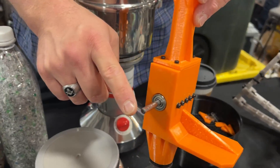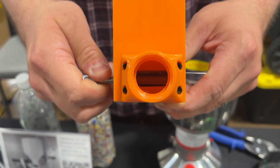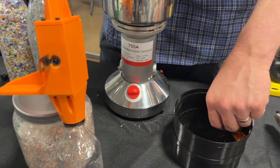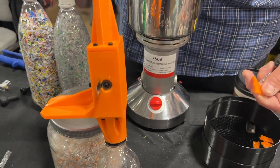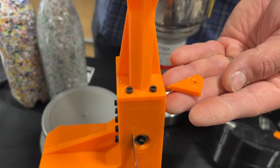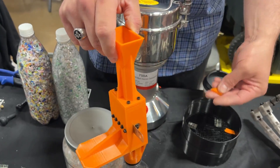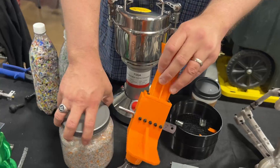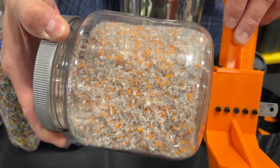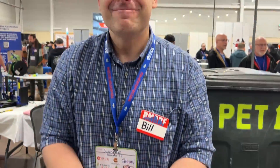It just uses a flush cut router bit you can buy on Amazon — they sell them in a two-pack for $15 US. It uses a stainless steel ruler as a cutting interface with the blades to cut against; the first couple of iterations didn't have that. HAL9000 is his username on the Discord — he came up with that idea. When testing it, you ask what can it cut? The parts should look awfully familiar. This is version 5, version 4, version 3 — used to test it. It works great. I printed with 100% infill solid PETG. If you look at all the bits in there, that's the kind of grinds you can get running it through a couple of times. All the orange dots should look pretty familiar — it's all the predecessors to the current version of the shredder. The youngling eats the older ones.